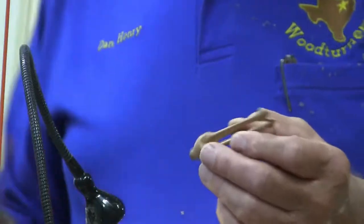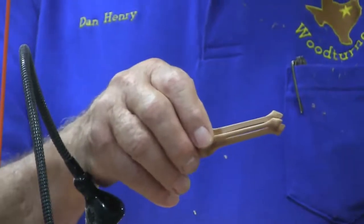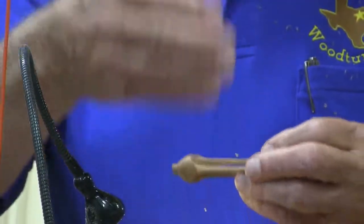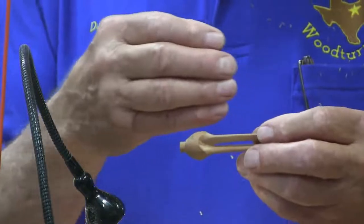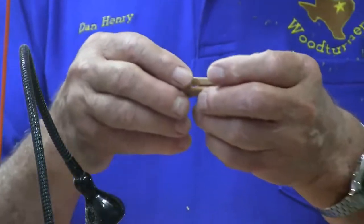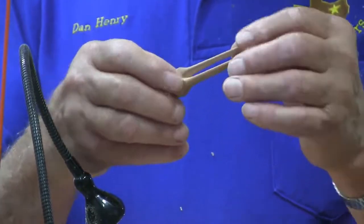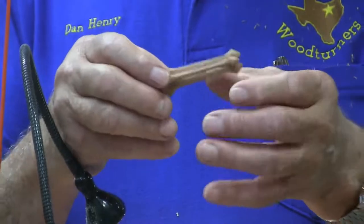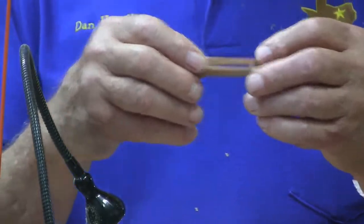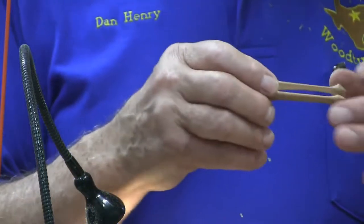But she set this up with that universal frame cutter with that triangular-shaped rosette on there, and a cutter will go all the way to the bottom, and come back out, and go all the way to the bottom, and come out. And you advance it maybe 5 or 10 thousandths at a time. So you're making numerous cuts to get this in that shape. And if you're really clever, you can make this into a spiral. I've seen some of them. You have to do a phasing in between each cut.